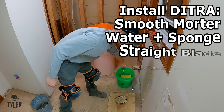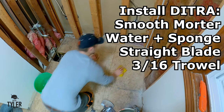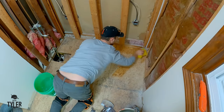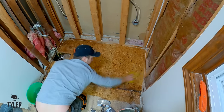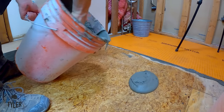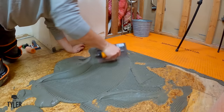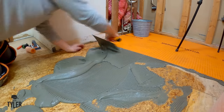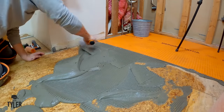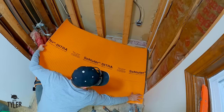At this point we are ready to put underlayment underneath the tile. This is a necessary step - I have overheard some people say they have not done this and gone directly to OSB; I would not recommend that, as you will likely not get the overall lifespan of your tile. You want to make sure it's nice and clean, then wet down the OSB or the underlayment. This is to make sure that the underside of the mortar does not dry out faster than the topside and prevent good adhesion.